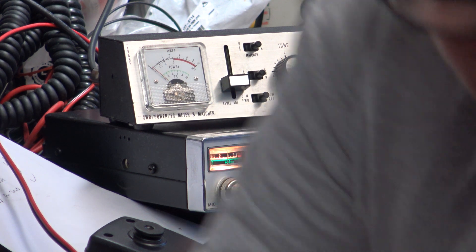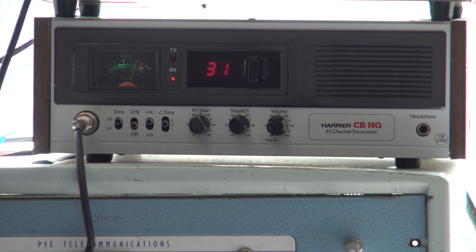Here's the final take. It's the Murphy DS602 running on a battery with the matcher producing an SWR of 1.3 to 1. Our set is actually slightly buzzier when presented to the matcher, but the customer set is slightly buzzier when not presented to the matcher - particularly when it was running off the car supply. Not a good result overall, but there you are. Thanks for watching.